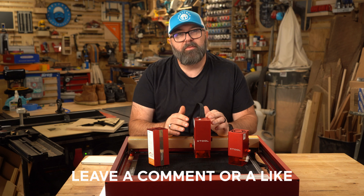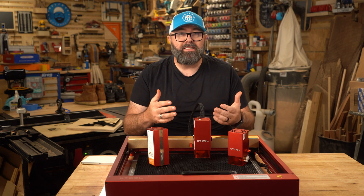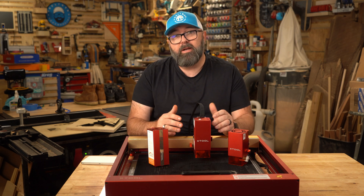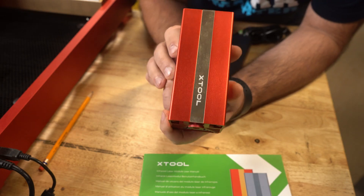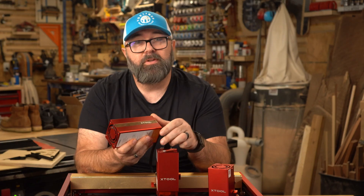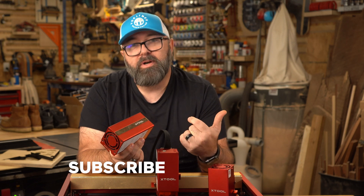This 40 watt module is very impressive, and I would say that if you're doing anything other than clear acrylic, this machine stands head to head with any 40 watt CO2 laser out there and can be upgraded in the future. For example, you can swap out the head to an infrared module and engrave other types of metals. I've got a video coming out on that — if it's posted it'll be right here, and if it isn't live yet, YouTube will put another video out there that they think you'd enjoy. Thanks.